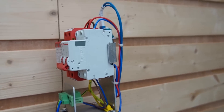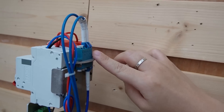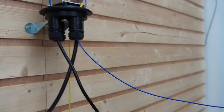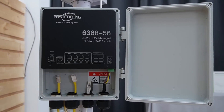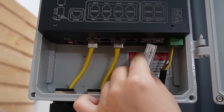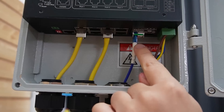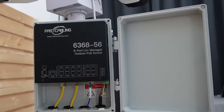On the back, we have the fiber optic cable — we have string 1 and 2. Remember, we used string 1, so I connect it with a fiber patch cord. Now the power and the data are going to be sent directly to our outdoor PoE switch. And by using PoE technology, we only need a single cable to power our bullet cameras, so let's plug in two of them, as well as our fiber patch cord — slide it into the SFP slot. And this is the power cable already connected.